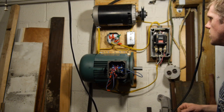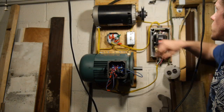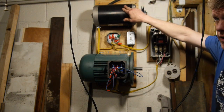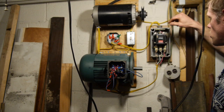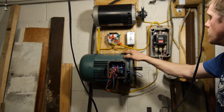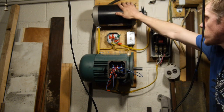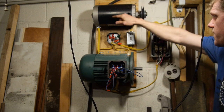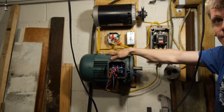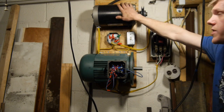I have two legs of 120. This 3 horsepower 3-phase motor is easy to pull start. But I don't need both of them. So I want this one to start and run 3-phase out to get this one live, then be able to turn this off.